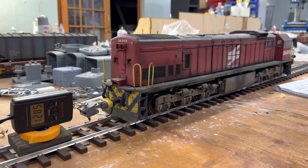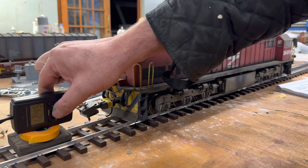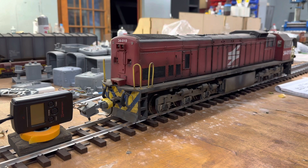Okay, so we have an average pull to calculate: 1,740 plus 1,500 plus 1,735 equals 4,975, divided by 3 equals 1,658. So the average drawbar pull is 1,658 grams.